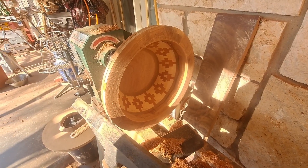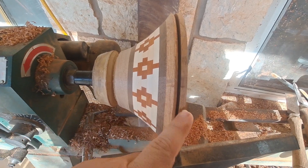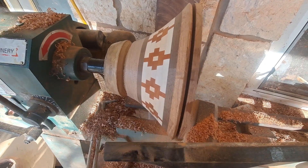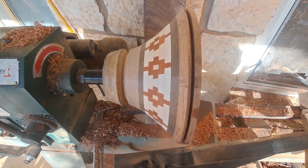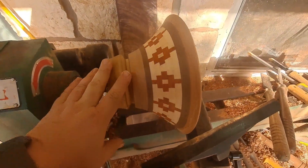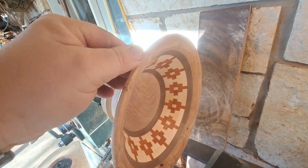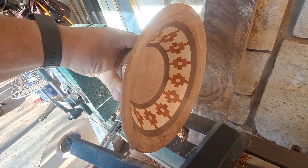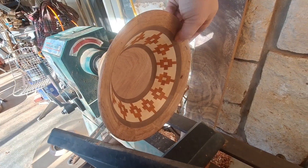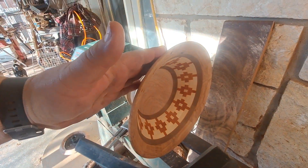I just got this one to where I'm ready to cut it off the lathe. I took the angle out as far as I could go — this is what's going to look best in my opinion. I'm going to split this off so I can reuse it on another project down the road. It'll be a nice trumpet-shape face bowl. Just got it kind of sanded up and turned. I'm happy with the shape, but there are a few knots and bug holes that affect the rim. I bought this black Star Bond super glue made for filling holes in dark woods, little knots, pin holes — I'm going to try to use it just so the wood gets sealed.